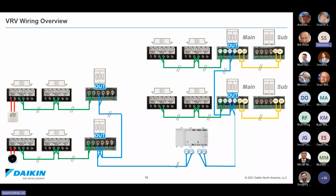From a wiring standpoint, like I mentioned, it is taking advantage of our powerful D3 net wiring, which essentially means you can connect up to 14 condensers to one single Pro Edge, but it is actually expandable all the way up to 56 systems. So it is quite powerful, and we use a simple daisy chain logic to connect all of the outdoor units to our Pro Edge.